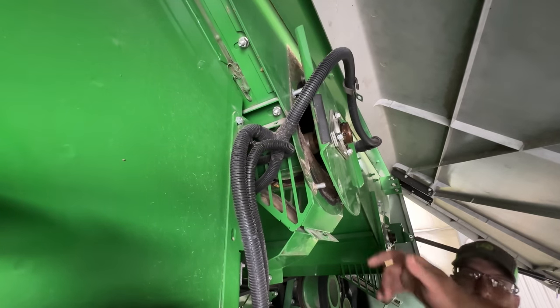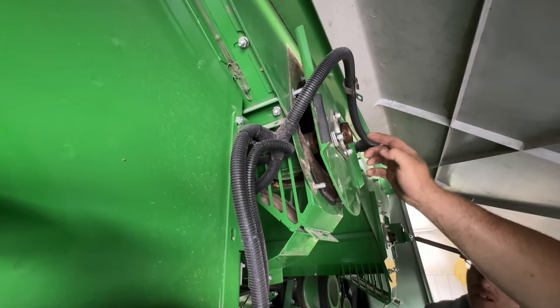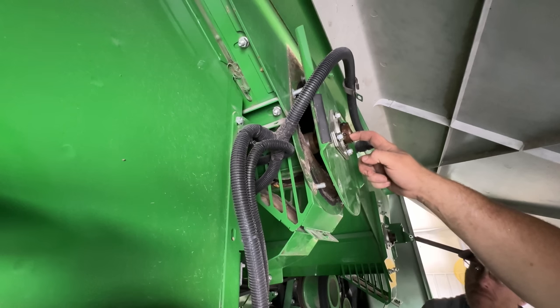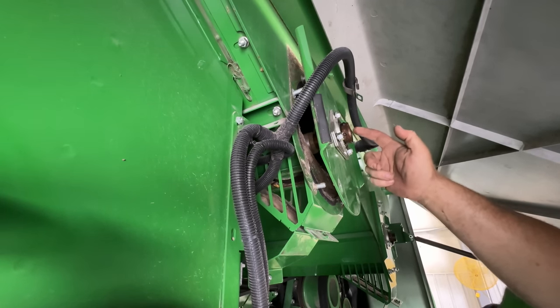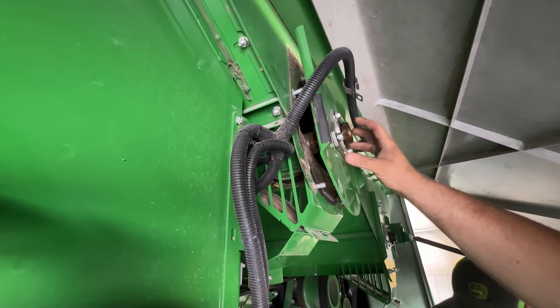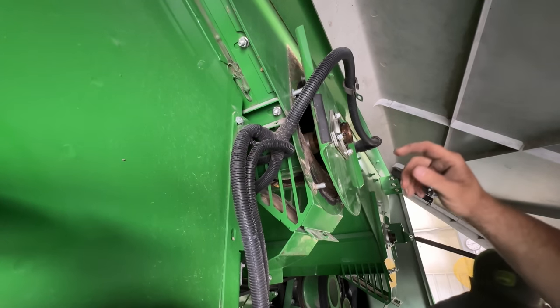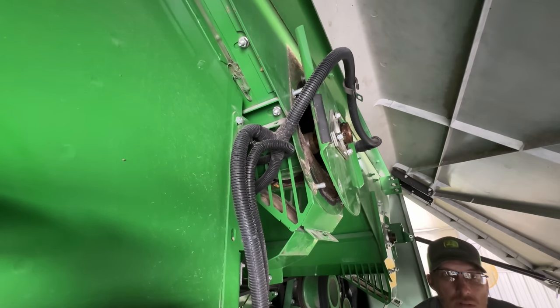So when you look from the ground up, like they always do, they used to have just regular lock collars on. But this is actually the inner race of the bearing, and they have two set screws. When you set those set screws, you put indentations in that shaft, and then when you try to pull a bearing off, you're fighting against those little dimples in the shaft, and now it's stuck and can't get it off. So we're gonna have to get a little bit more creative.